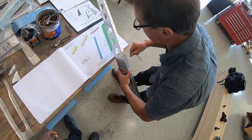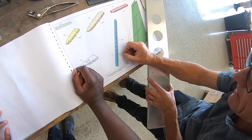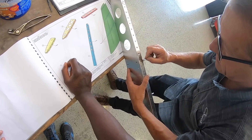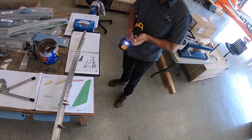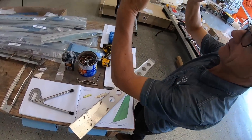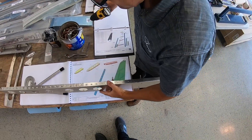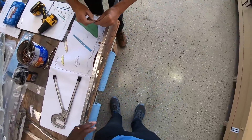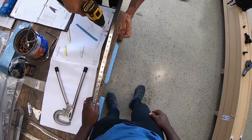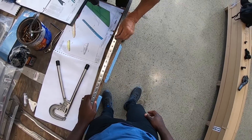There's our component — dimpling goes all the way from the top down, and then it stops there. Those holes at the front are smaller than the others. After dimpling, if you looked at the hole very closely, the inner edge would actually tear slightly. So what we've got to do now is just clear-drill all of these to clean up the hole. The dimpled hole started at 2.8 millimeter, the 3.2 millimeter rivet doesn't quite go in, so you just clear-drill that until you get a nice tight fit.